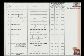Designated letter B, the continuous thin lines. This is a thin line. Then we have a freehand line which is designated as C. This is a thin line. Then we have continuously ruled with zigzag. This is just like a heartbeat. This comes at particular intervals, say an interval of x distance between two of them. So the third zigzag will also come after x distance from this particular zigzag line.